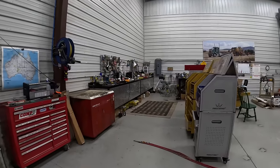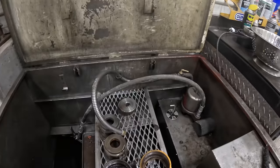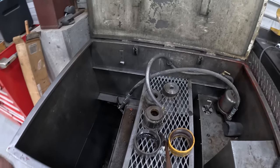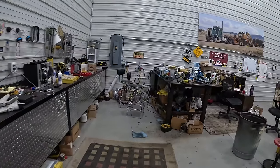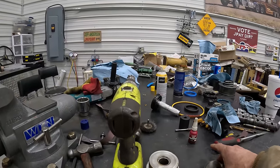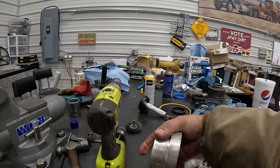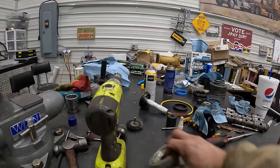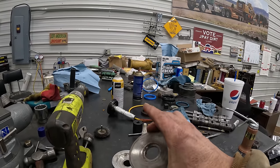It worked beautiful. I got them undone, I got the nuts in here and the glands, the barrels are laying down there and the solvent. But I want to show you something. So somebody put this piston on backwards. It's supposed to go on like that, and then your nut goes in here, and they had it the other way, and then they took this and tightened it down and just bent the snot out of it.